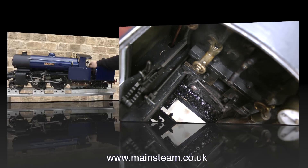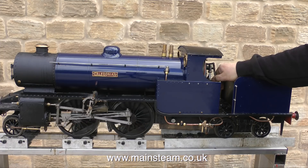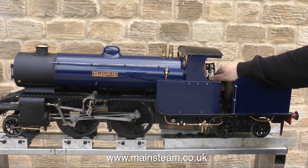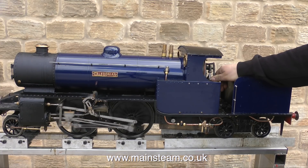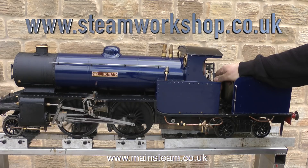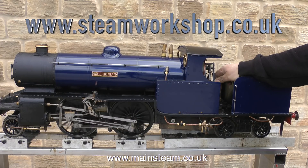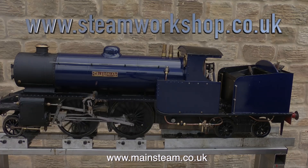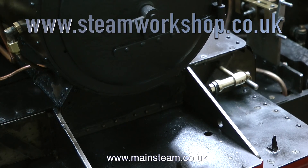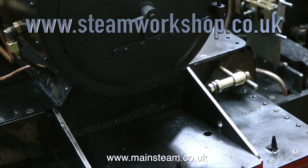My final job at the Steam Workshop in this video is making a part for this engine. This clip shows the steam test of the locomotive featured in a previous video — it steamed very well indeed and both injectors work. There was just one problem: the cylinder drain cocks couldn't be opened using the lever in the cab because it wasn't connected up. That was a simple fix — I just made this brass fitting to connect the push rod to the lever that opens the valves, a very simple piece of plain turning, drilling and threading.